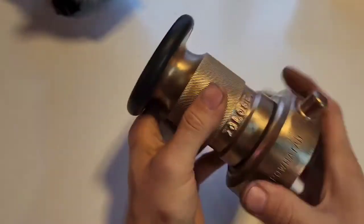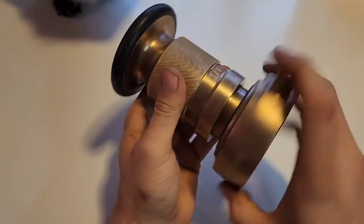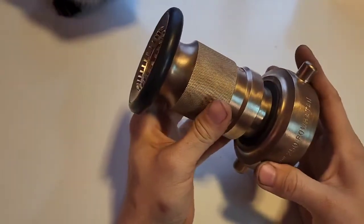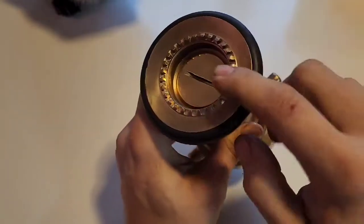It's because of the flow. You need to turn off 250 gallons per minute of water shooting out of this thing rapidly. And if you had a rubber seal inside there, it would get ablated away by the water — it would just erode it away and it'd be no good as a seal. So you need that metal on metal.